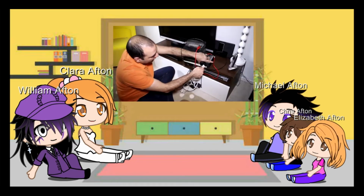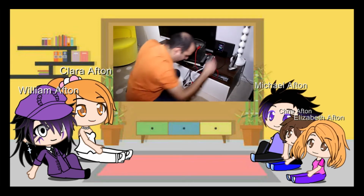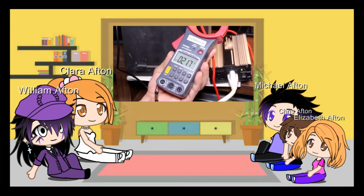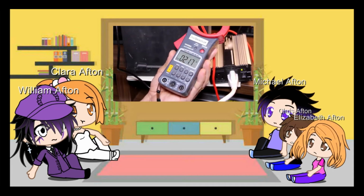With this, I plug the entire setup into my inverter: the TV, digital box, my phone, the radio, and even the light. The setup is drawing around 22 amps from the battery, and my battery is around 75 amp hours, which means it will last for more than 3 hours. So I'm set.